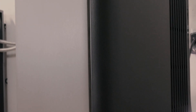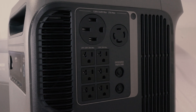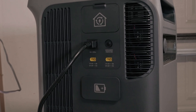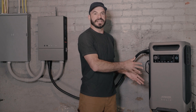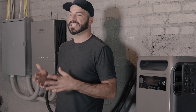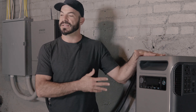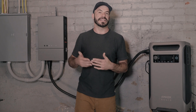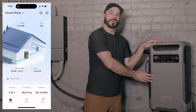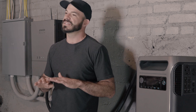Because the F3800 and Home Power Panel can power the whole home, we are able to ensure full utilization of available solar energy and decrease the proportion of electricity drawn from the grid. Power from solar panels connected directly to your F3800 is the primary means by which it recharges its internal battery. It then powers loads and devices in your home, biasing power from the battery based on programmed electricity costs. When grid power is cheap or solar is abundant, it runs your home off those sources and recharges the battery. Later, when peak pricing takes effect, it relies on the stored battery energy to run your home's devices, keeping utility costs at the lowest possible.